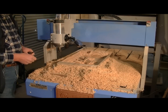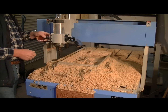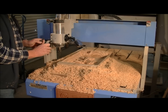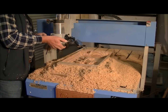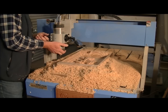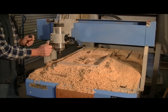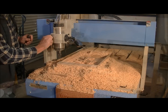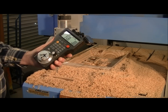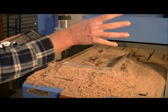I've just put the 6mm bullnose in, but now I need to lower the motor down — it's fixing — so I don't run out of thread on the Z axis. Just support the motor, ease the clamp a little bit. A little bit too far down — it's as simple as that. If you buy one of these machines, I do recommend getting the pendant. It makes life a lot easier because I can now control the machine with the pendant.